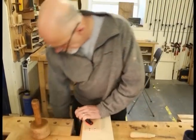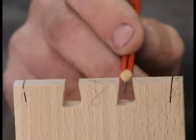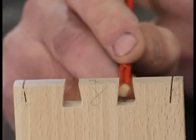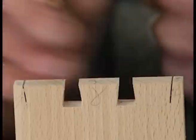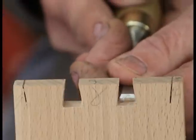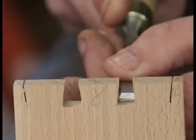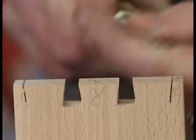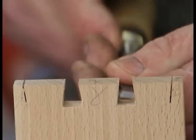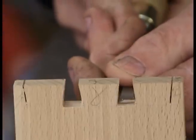I'm now going to put it into the vise. We've got two reference surfaces — this line here and this line here — and on this edge as well. Two sloping surfaces come to a point — that's the apex. What we've got to do is get rid of that. If I drop my chisel flat onto the reference line and pare across, lifting my right hand up, it should have the effect of moving that apex back. Goes without saying — you need sharp chisels for this. I've moved the apex back and I'm going to take it a little bit further, then come in from the other side.